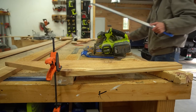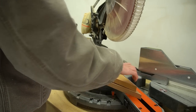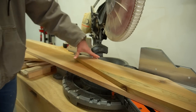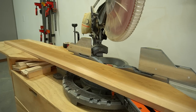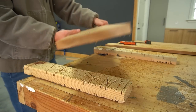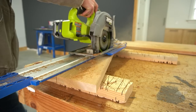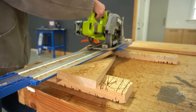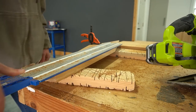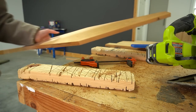I hung on to the triangle piece I cut off to use in the very last step. I took this leg back to the 1x8 at the miter saw and traced it out to make a second one just like it. I adjusted the saw back to 15 degrees, cut the 15-degree mark first, then brought it back to the circular saw and cut the long top edge. Don't forget to keep that triangle off-cut! This gave me two identical back legs. I set the remaining 1x8 board aside to use for the armrests later.